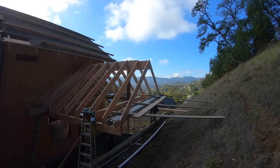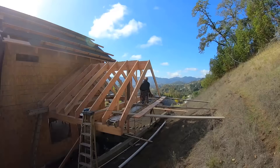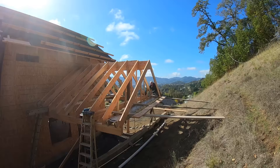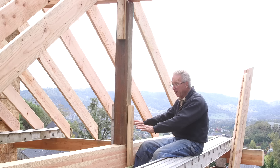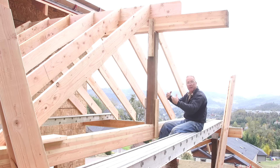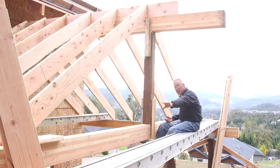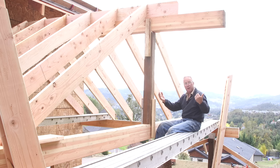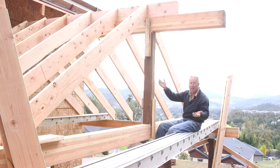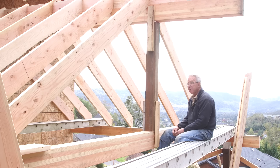But if you do mess up layout and get several rafters in the wrong spot, sometimes it's less work to fight the roof sheeting through that one area than to stop, tear out, and relocate several rafters. This porch is going to get a ceiling, so everything on the bottom side of this roof diaphragm will be invisible. But the overhangs are not invisible — just like the rest of this house, we'll have false tails on the eave, and the overhang on the gable end with barge rafters. These last rafters have been lowered — the seat cut deepened so the top of the rafter comes down — a similar problem to ones solved on other gable ends, just a slightly different solution.